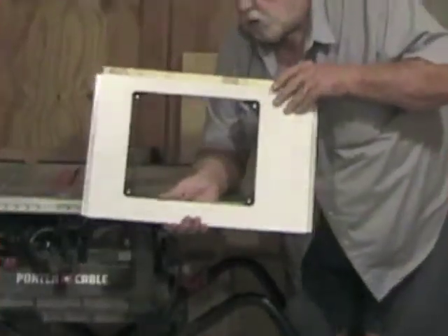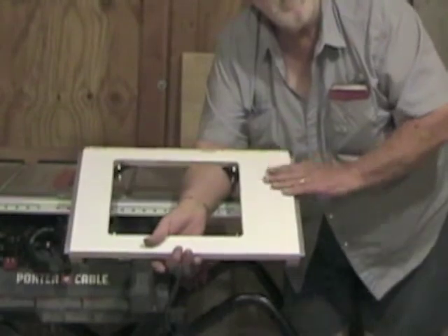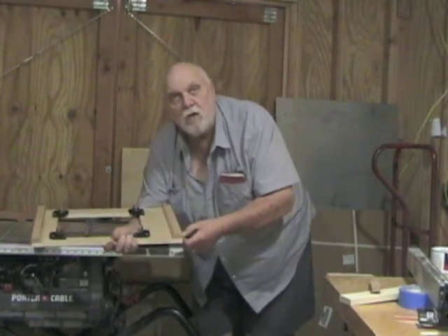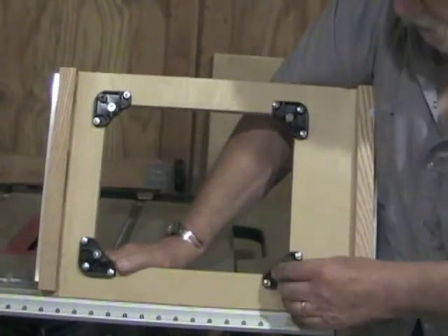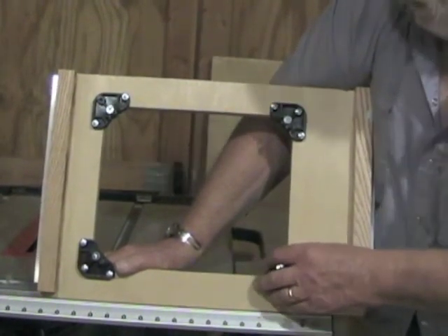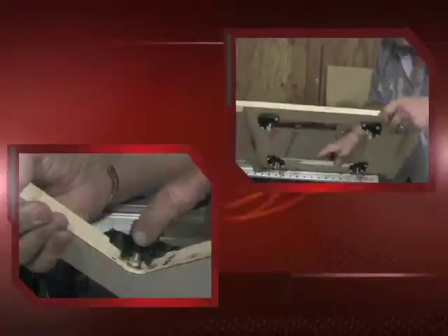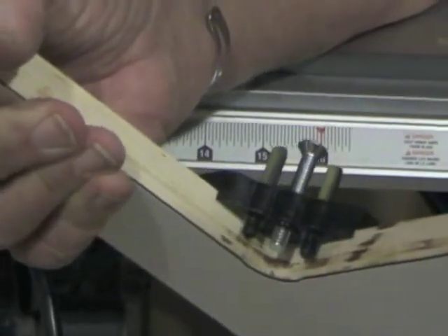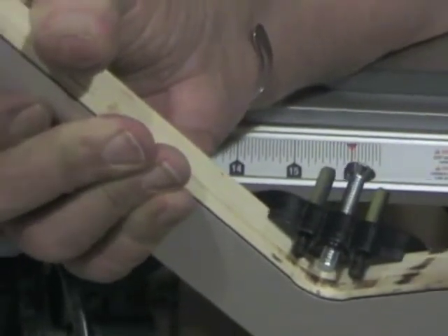You'll see why in a minute. It's plywood covered with white formica — like your kitchen countertops — but it's real smooth. On the back side there's some metal wood-reinforcing pieces for where I put the metal stops. And these black things are Kreg inserts that go in a router table, so you can close this hole up. These things are adjustable — you screw these screws in and they move up and down. There's going to be a plate that sets in this hole, and you want it flush. The screws on all four corners allow you to make it flush and give you an adjustment for plates of different thicknesses.